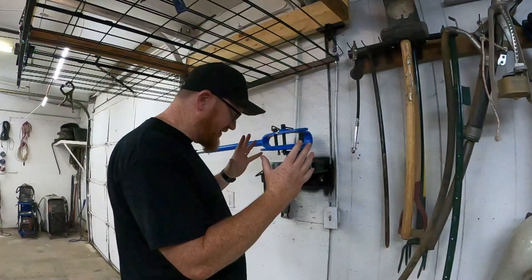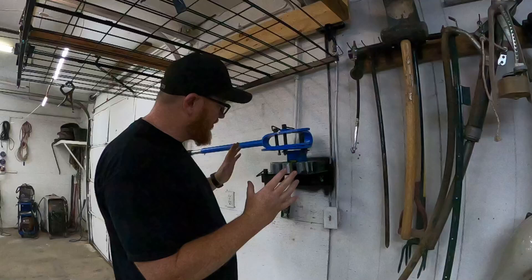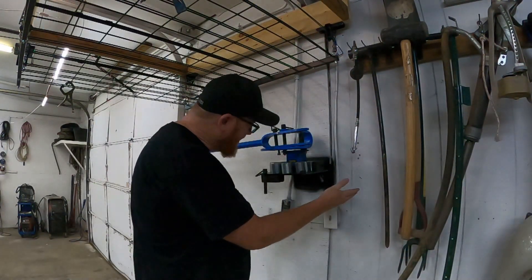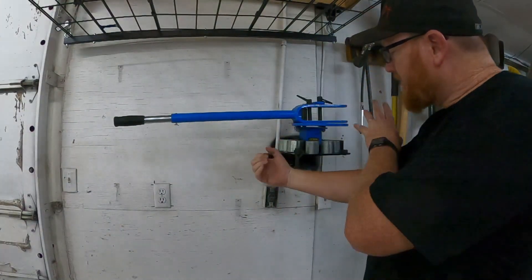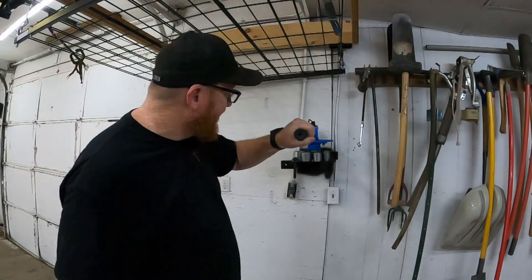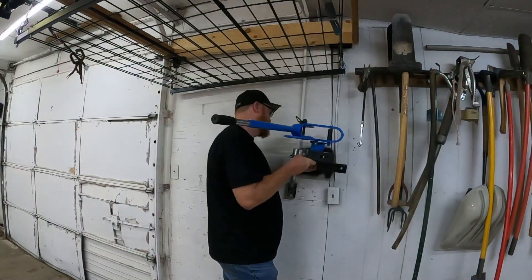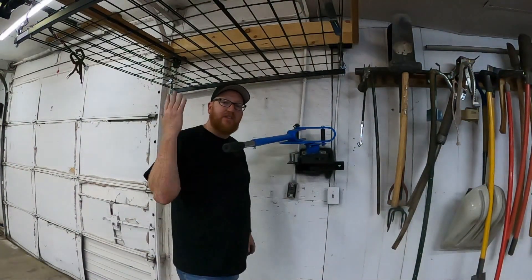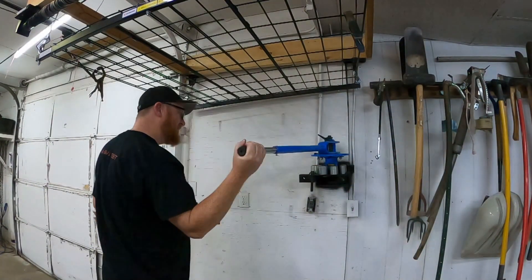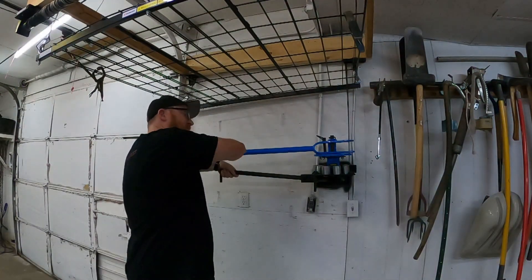I don't have the floor space to mount one permanently to the ground, so having this mounted to the beam in my shop is going to work great. I may need to shim my square tubing, but I'm able to get in here and remove the pin. I added side tubing so I'll be able to switch and move this if I'm doing a long bend — for those longer bends where the wall would get in my way, I can come around and bend it, then take this out, set it in the next notch, and finish my bend. If I were worried about torquing this over too hard on a heavy bend, I can always set up a pull in here to get some scissor force together to press and bend.